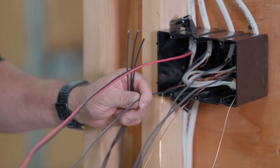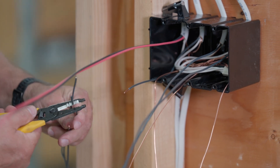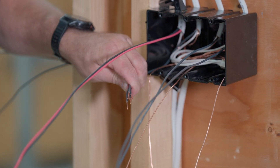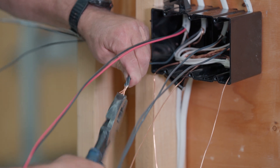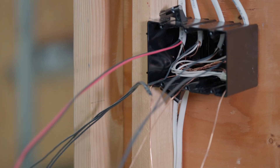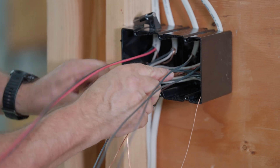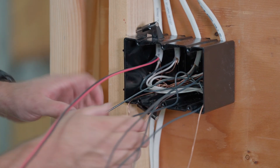I'm going to get three conductors, cut and strip them — you can usually find scrap wire on the job site. You need three hot conductors, and then using your linesman pliers you're going to twist them all together perfectly, making sure none of them slip out and you have good contact with all conductors. Twist them a few times, then put your tan twister on and make sure it screws on real tight. Push that to the back of the box, then you'll have your hot conductors — one for this switch, one for the center switch, and one for the three-way.